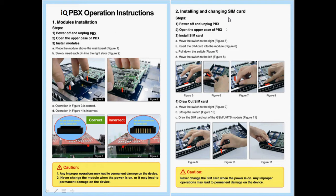Even if you are changing a SIM card — GSM gateways are single SIM — if you wish to replace a SIM card, any form of opening the casing involves powering down the system. Cards are not hot-swappable. You must power down the system to prevent any damage, even if you are replacing a SIM card.